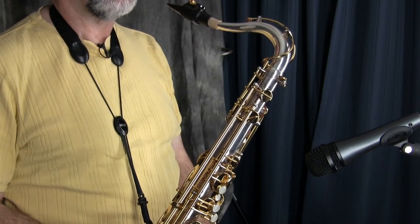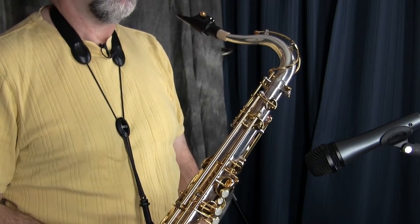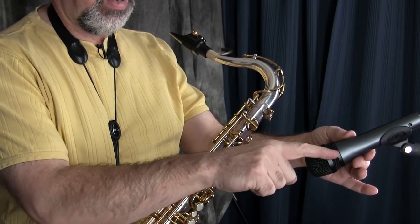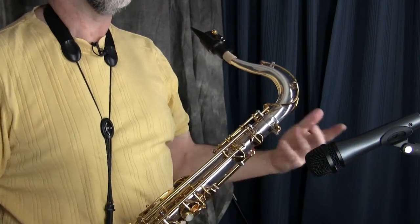There is a particular variant on this mic made by Sennheiser — it's an excellent microphone for saxophones: the MD-421. Because the MD-421 has a metal band that goes around the microphone, it looks like a side-address mic, like a condenser mic that we use for recording. So sometimes people try to blow into the side of the microphone. That's really not going to do any good, because you want to be on the capsule. These mics have a cardioid pattern — in other words, they pick up more sound from the front and reject sound from the rear to reject feedback. If you're trying to blow into the side of a mic with a cardioid pattern, you're going to suffer from poor response and poor frequency pickup.